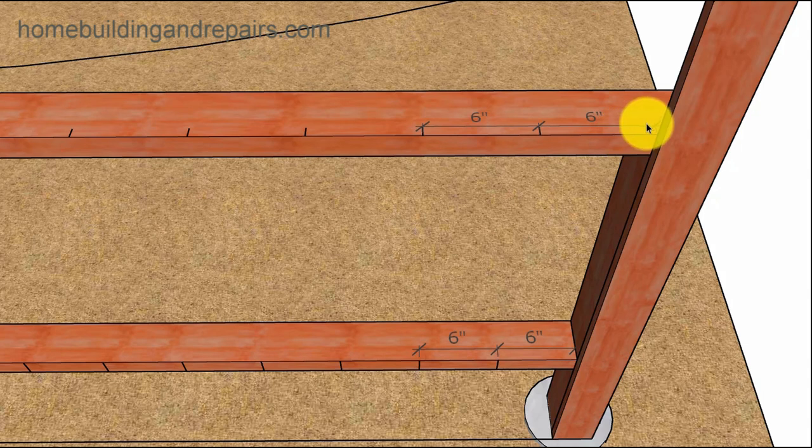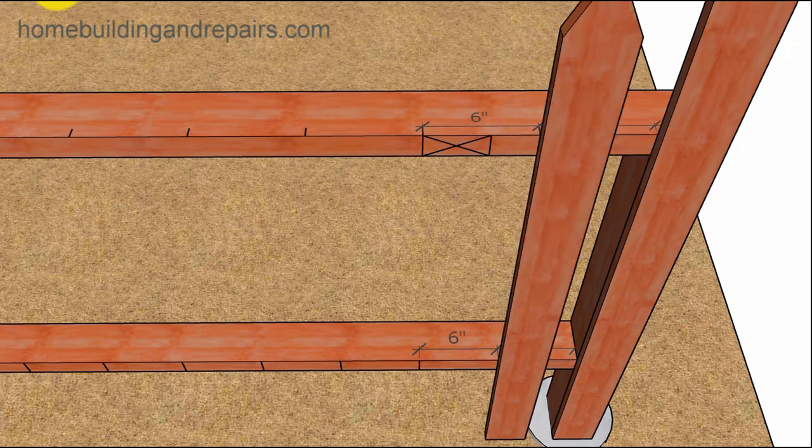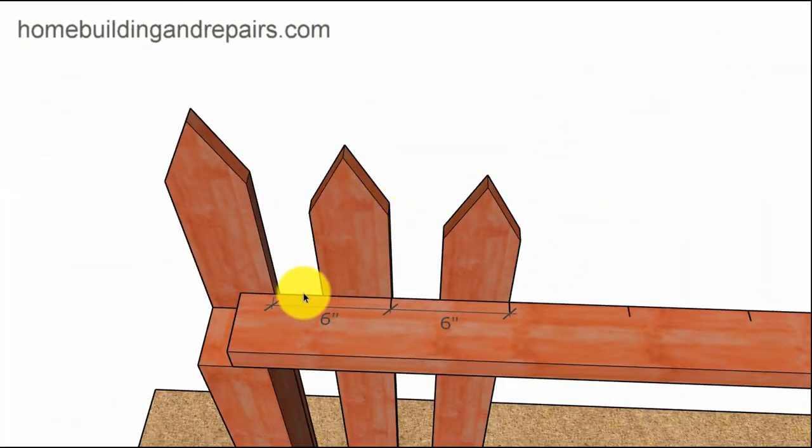For this particular fence it's going to be a six-inch spacing — that's a three-and-a-half-inch wide picket, or fencing board, three and a half inches wide with a two-and-a-half-inch space in between. You can do this a couple of different ways: you can lay out the space in between the pickets, then the picket, then the space, then the fence picket. Take a look at it from the back: two and a half inches, three and a half inches.